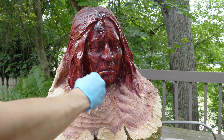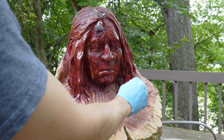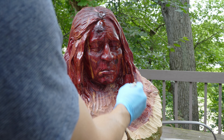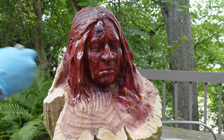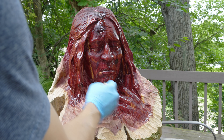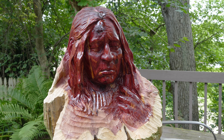I've done some spar finish before — an oil-based finish on the cedar — and the oil-based finishes do really darken up the juniper a lot more than other finishes do. For better or for worse, but I think it's for better. I think it's a beautiful color that you get from this juniper. Amazing, amazing finish.